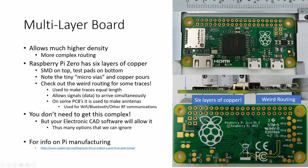Something else to look at when you're looking down here is there's these really cool wire routings right here, and you'll see these two wires come all the way along right next to each other all the way here, and then just before they connect, this one goes off and does a little bit of a dog leg for no apparent reason. Well, if you look at how they're traced, they come around this corner, the inside line is slightly shorter because when it goes around a corner, it's always got the slightly shorter side.